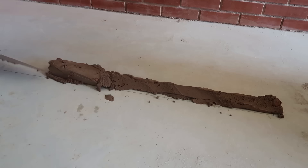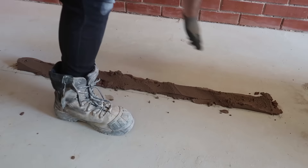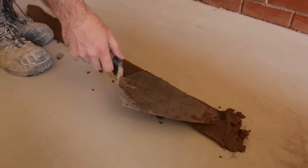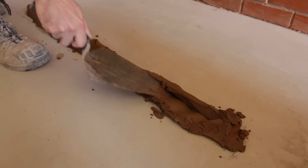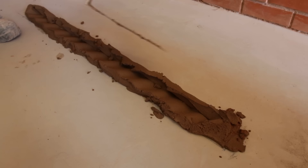Continue all the way down the line until you come to your end point. When you've got to that point, just cut it off so you know your end brick. Then we're going to furrow our bed. When furrowing, don't go daft — just a nice gentle furrow. Hold the trowel parallel to the mortar line, come out at about 45 degrees, and use a gentle tapping motion coming directly down that line with the tip of your trowel.